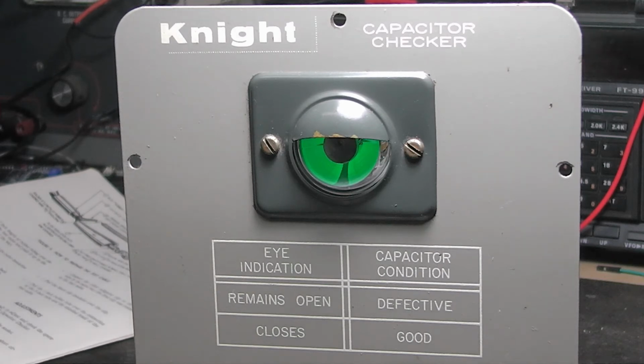I was looking at different coax options, because the book doesn't say what kind of coax they're using, and this has no markings on it. I've looked with the magnifying glass in case it just faded out. There's nothing showing what coax this is. So I got some, I think it was RG62, which is a 93 ohm coax. I researched different brands, and it's got about the same circuit. That's okay, that's just what I'll do. You can get plenty of RG62. I got a little small roll of it, cut a piece 4 foot off of it, made up nice little pretty ends on it, and put it on there.